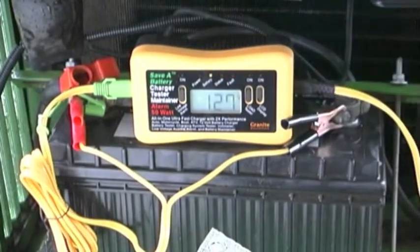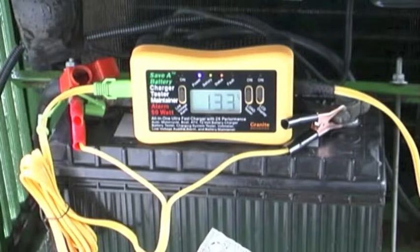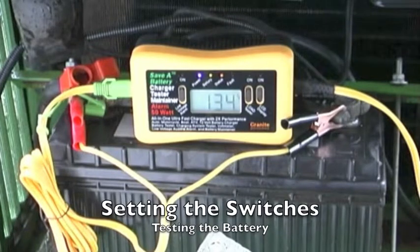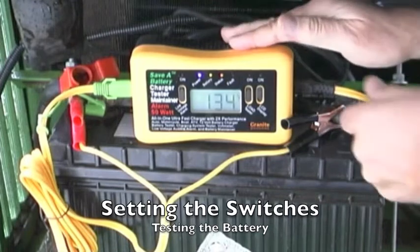what happens here is it first of all turns on the power light, then it looks to make sure that it can charge the battery, which is a green LED, and then the status light starts to blink, and whenever the status light is blinking, it's in one of its 4 phases of charging. So when it comes on solid, it's totally done charging, but depending on the speed of the pulsing of the little LED tells us what phase it's in.